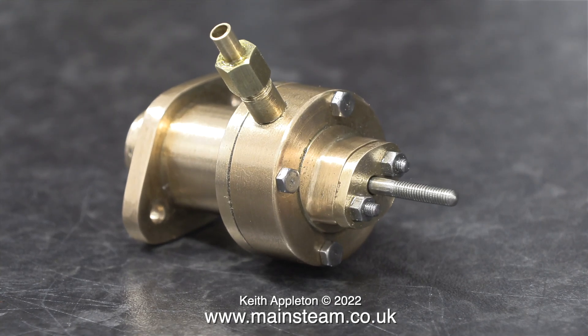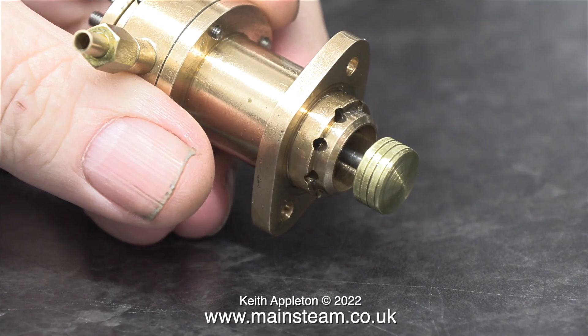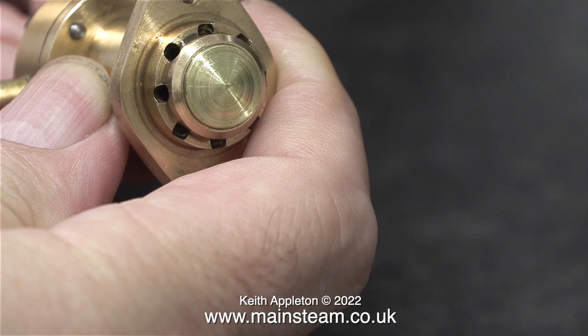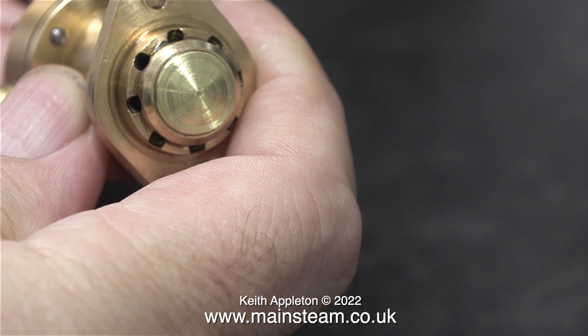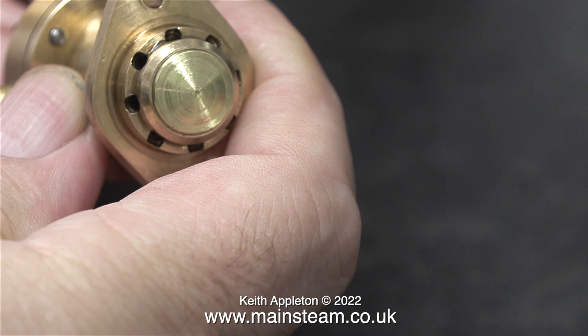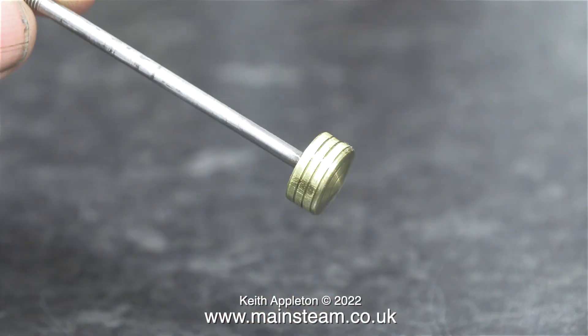For the rest of the video, I will be using the Canon X400 camcorder. This is the vacuum pump that I've removed from the Stuart Triple Expansion Engine. Here are some clips showing its construction — it's not as simple as it looks. This is the bottom part of the pump, and this bolts into a mounting which is part of the engine's sole plate. I had to remachine this part of the piston because it wouldn't go down far enough. The problem is the size of the piston prevents it from travelling to its full extent in an upwards direction.